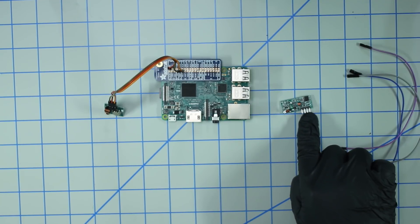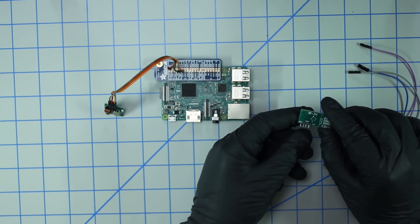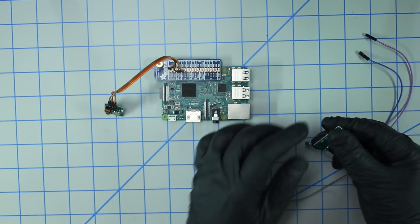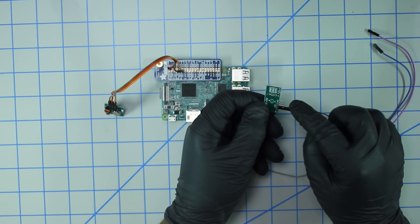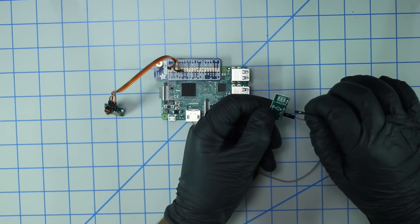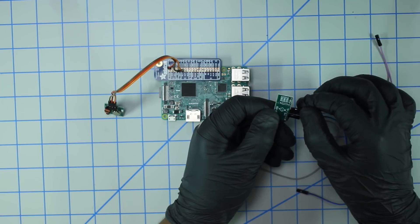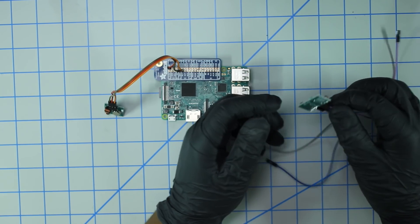Now we need to set up the receiver. As you can see, there are four pins but we're actually only going to use three of them. If we flip it over we can see the labels. The first pin we're going to hook up is ground, so I'm just going to take this gray cable and hook it up to ground. Then we're going to hook up to the data pin — there are two data pins; you want to hook up the one on the farthest side, closest to VCC. Then finally, hook up VCC with your last jumper cable.